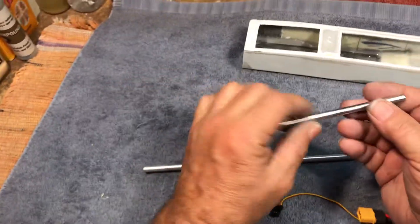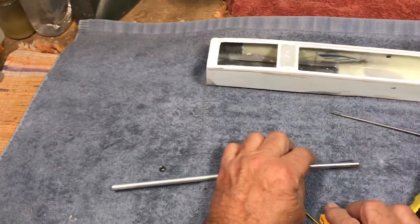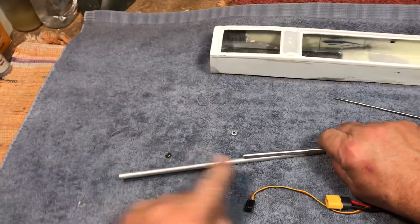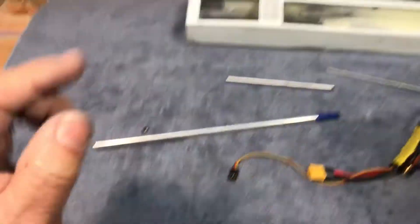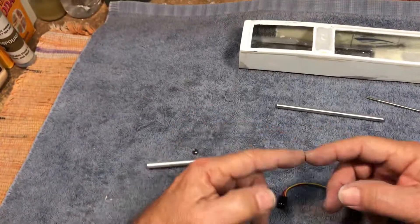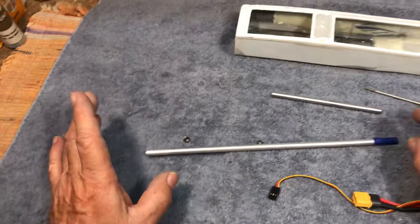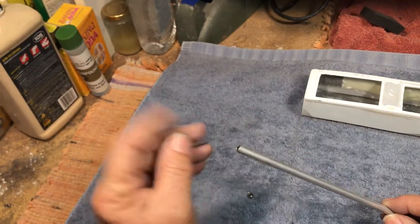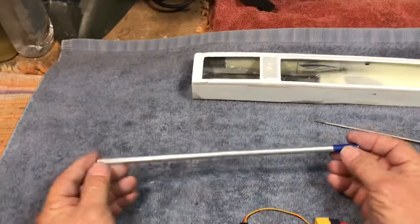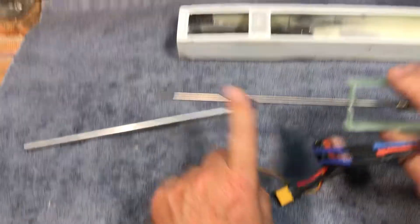And in the middle, I take a piece of quarter-inch tube and glue it with Loctite inside part of the shaft. The secret is you do not want this center bearing in the exact middle of the shaft — it would be a node and that thing could vibrate about that node in a harmonic. So you want it slightly off center. Now I have a drive shaft supported by three ball bearings that are not equal distance apart. This will eventually be my stuffing tube once I get my drive shafts.